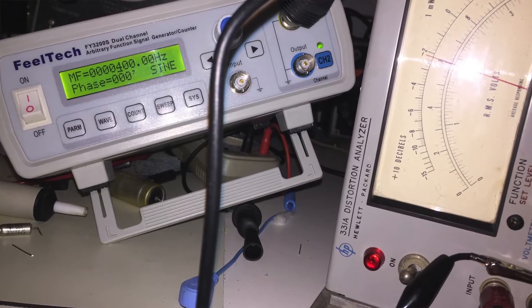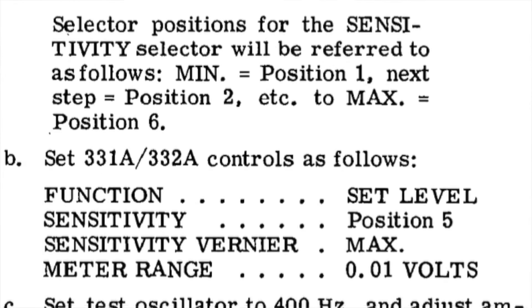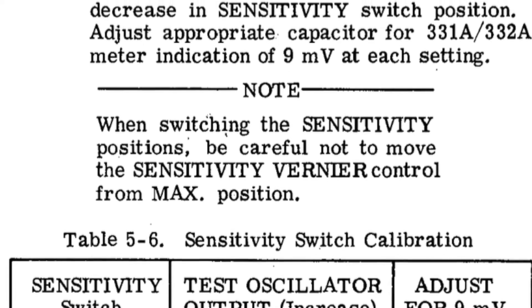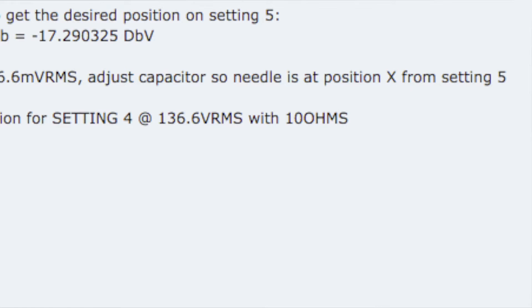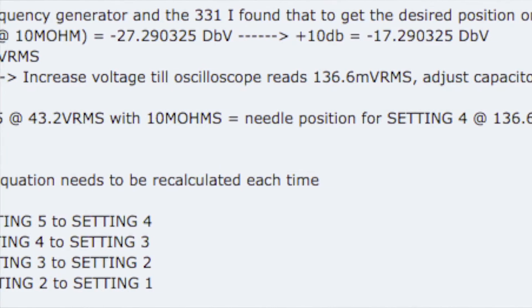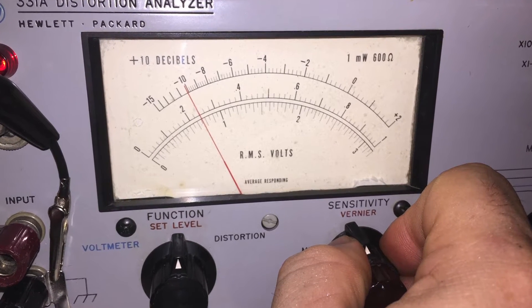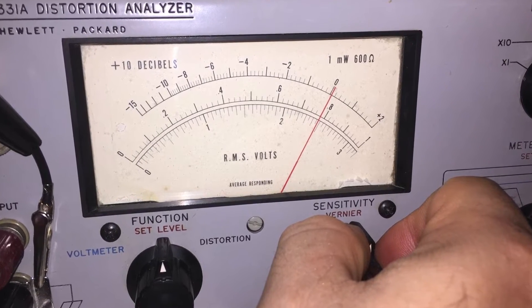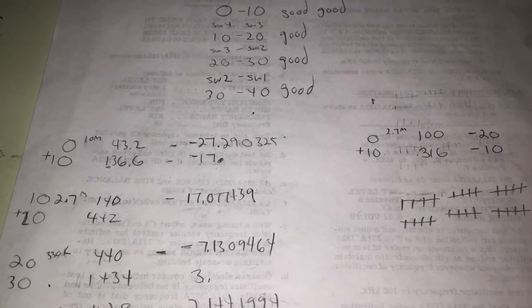The 200 kilohertz is adjusted by S3C1, also done without any issue. The sensitivity switch was by far the most difficult of all the calibrations. I had to work within the parameters of the test equipment available, since increasing a voltage by 40 decibels was not possible on my equipment. I used different resistors to load down the circuit to get more specific and accurate measurements during the 10 decibel increases. As a sanity check, I would set the sensitivity vernier to negative 10 dB and then advance the sensitivity one position up by 10 dB, confirming the signal appeared at zero, using this to verify corrections along the way.